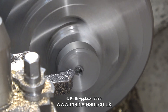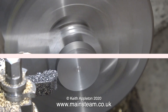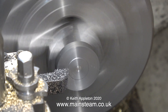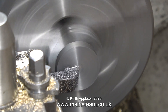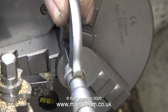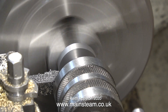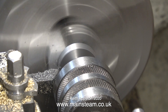First though, I'm just facing across the front to clean it up. As it's only supported by the piston rod, I'm taking quite light facing cuts. In this sequence I'm also reducing the thickness of the piston blank to exactly a quarter of an inch as shown on the drawing. The sequence is short but it actually took a good bit longer — finally the micrometer fits on it perfectly at a setting of a quarter of an inch. Now it's time to reduce the external diameter of the piston to one inch, or maybe a couple of thou under one inch.